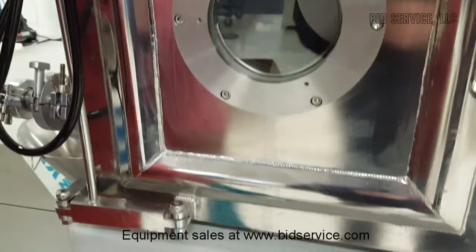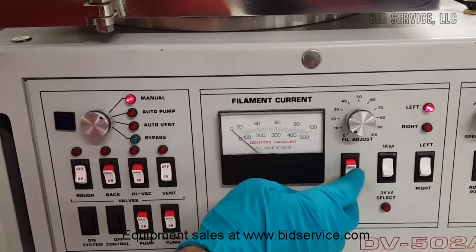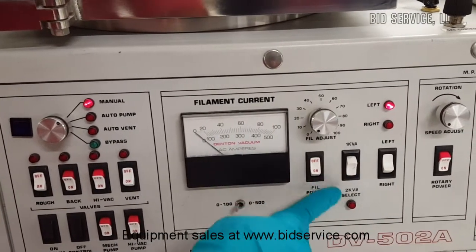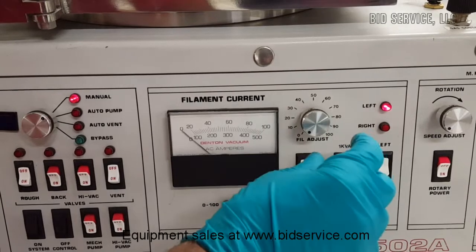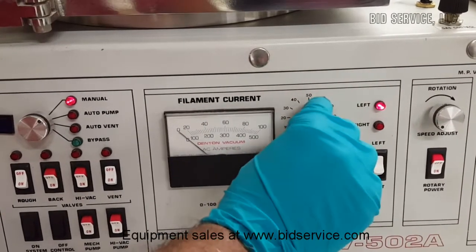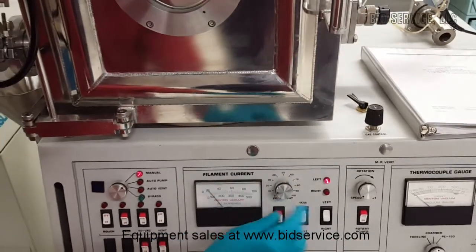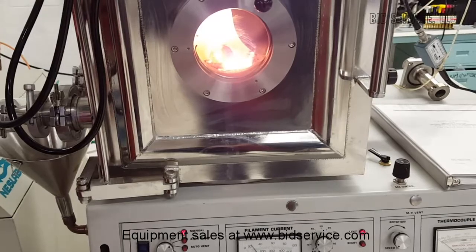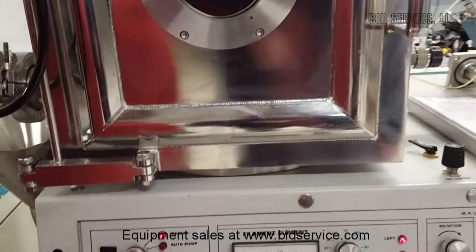The meter can be selected for zero to 100 amperes or zero to 500 amperes. You can select either range depending on the selected transformer. I am selecting the 2kVA transformer and going to the zero to 500 amperes range. I am going to start this slowly — when you see the current go up a little bit, increase the heat slowly. In this third filament, the electrode feed-throughs are water cooled. I am going to show you on the back side.